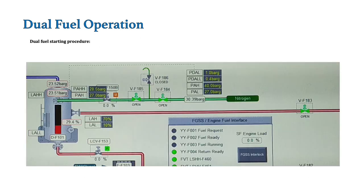After the seal support system is started, we have to go and open the valves of the nitrogen for the cache tank. We have to open these two valves for supplying nitrogen to this cache tank. When the system is stopped, we are always keeping these valves open. But when an emergency stop occurs or when the system is stopped in an emergency condition, these valves will shut automatically. So we have to open this valve before the system is started. This cache tank has a small amount of level maintained, which basically provides positive suction head for the HP pumps.